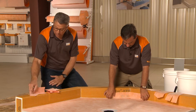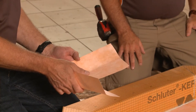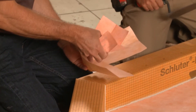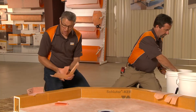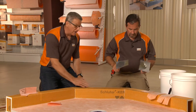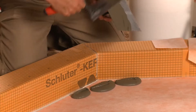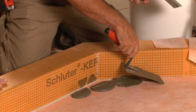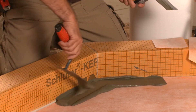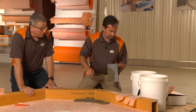If you don't have these corners. And of course for years and years, Schluter allowed you to just do a lap like this for our 90 degree before we had these inside corners. So that's okay, but we'll see how to do it when we get here to this 135 or 22 and a half on this 45 degree here on this curb. So as usual, we're putting the thinset down here and we're going to use our KERDI trowel, which is a proper notch or an equivalent trowel to about that notch.